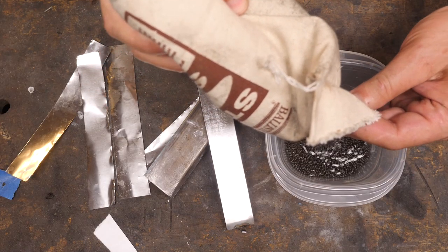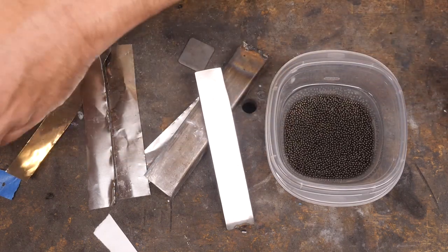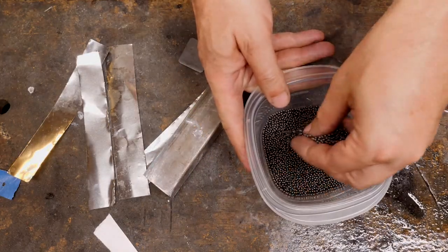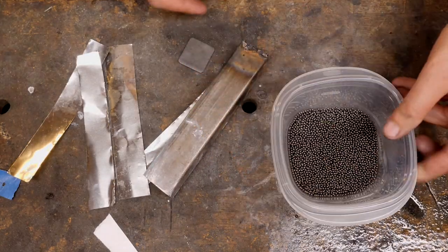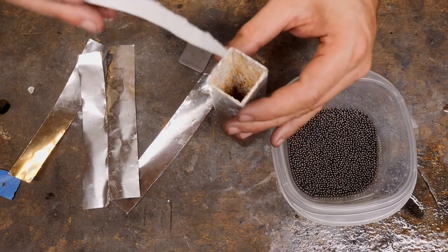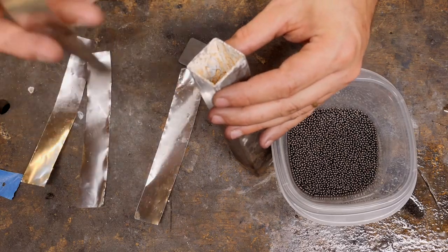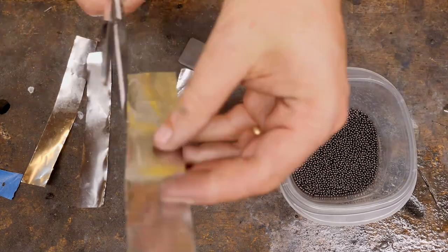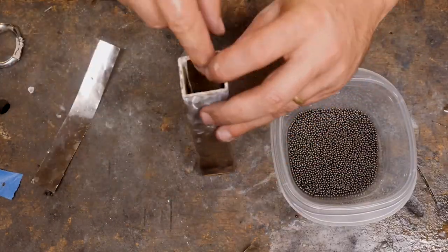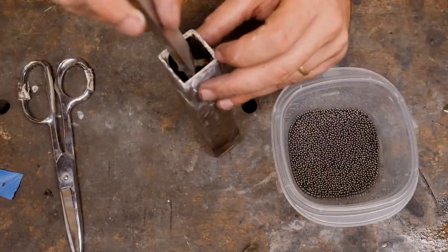Our BBs are going to be soaked in acetone and the canister construction will begin. That's right, I'm going to put a piece of paper in here. That's because there's a lot of extra airspace between those BBs. It's not filled up with steel powder in this case, so we need to get rid of that oxygen by burning it up with this piece of paper. That way it won't cause oxide formation to interfere with our forge welds inside the canister.